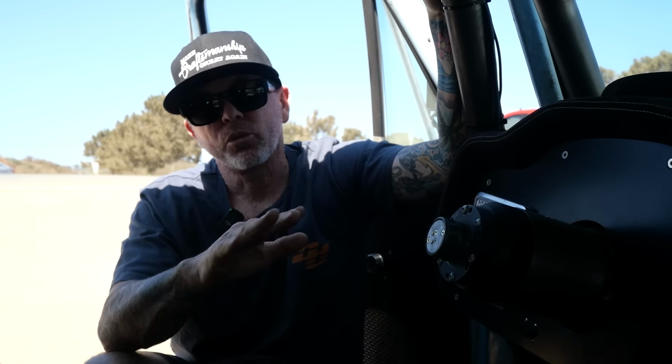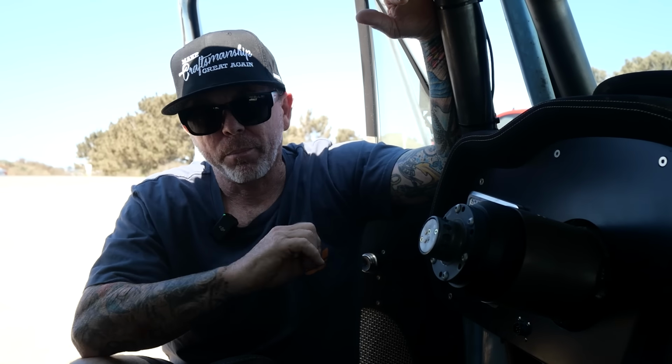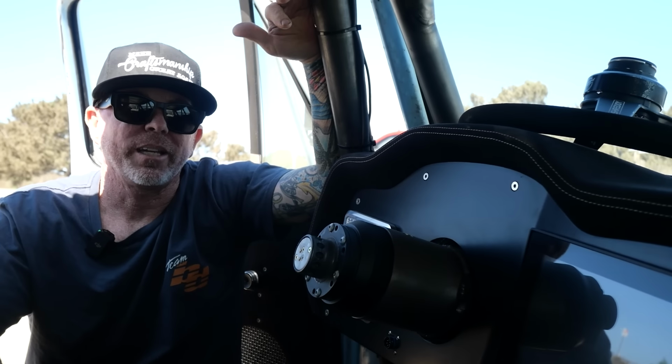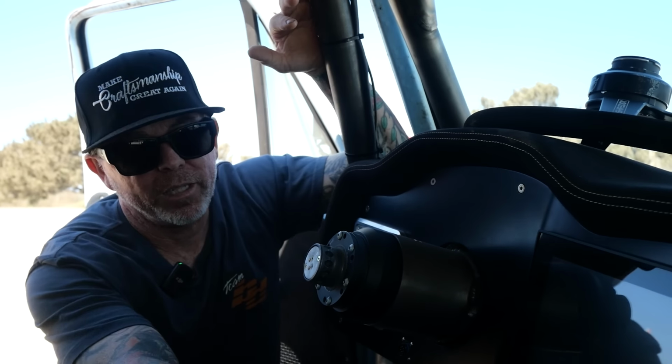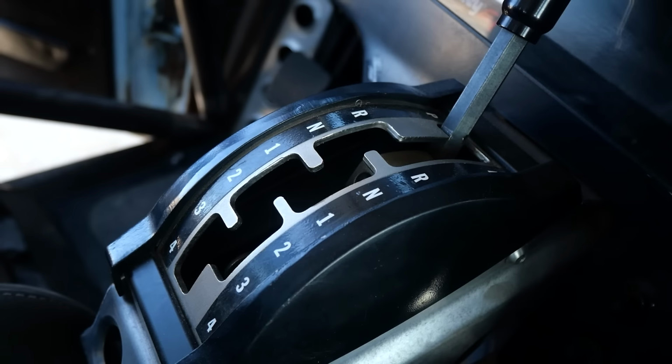Engine, we did on V2, Morgan addressed a lot of the cooling issues, and it is absolutely so much better. Even driving down here, my water temperature was so much cooler. This motor, if you guys don't know, it's an LSX 454, but it's not a stock motor. Robert Maruzzi built this thing from the bottom up: custom pistons, custom rods, Frankenstein heads, big, huge cam. We're talking about an 825 horsepower all-motor monster with a 4L80, which a lot of guys don't know. I have a 4-speed, so I can cruise on the freeway.